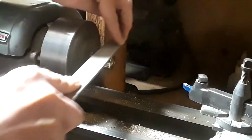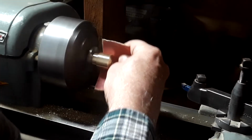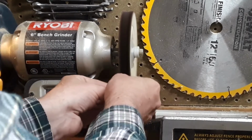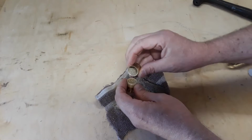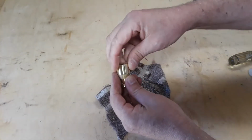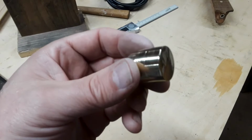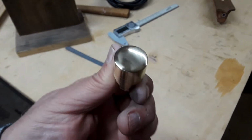The two plumbing parts are screwed together, so you have to take care to not turn off too much material and get into the threads. Even when cleaning things up with a file, sandpaper, and buffing wheel, that possibility is always on my mind. The cavity inside the two parts lets me use some of the shot that was inside the old dead blow hammer. I don't think it really does anything, but why not? There's no reason to spend any time at all turning this part, but I've managed to spend a good part of my day making something shiny.